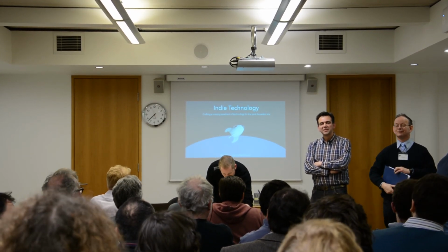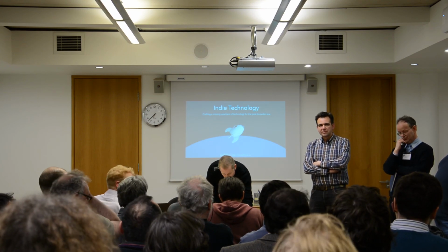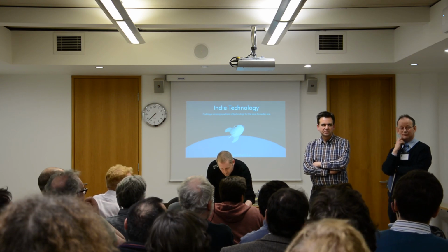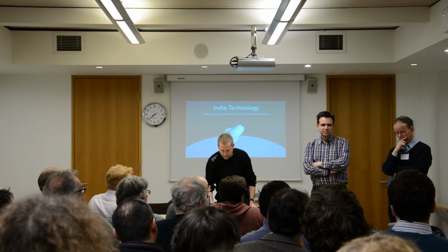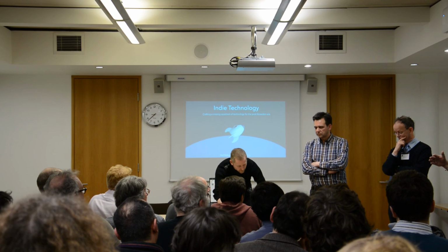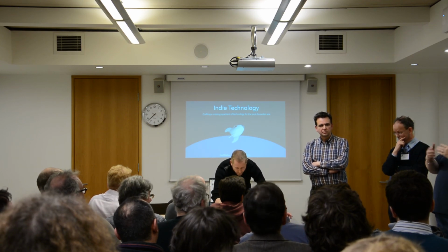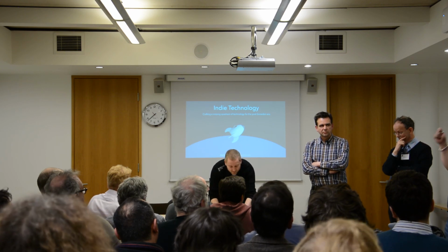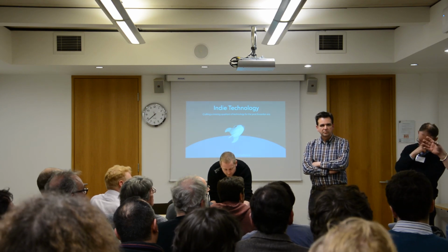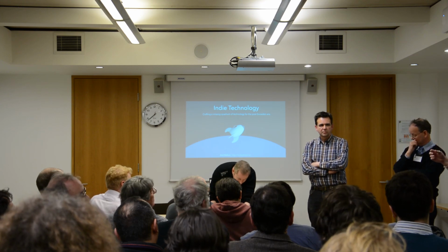Sorry, two questions. Could you create new cards, like cards with IDs that were previously unknown, if you use the master key? So yes, potentially, if you knew the master key, and also depending on whether they were loading the cards onto their system as a batch when they purchased them from the manufacturer. Quite often they'll purchase a batch of cards. When the cards arrive, there'll be a disc with the cards that has all the serial numbers and any data that they need, like transport keys, etc., to access those cards.